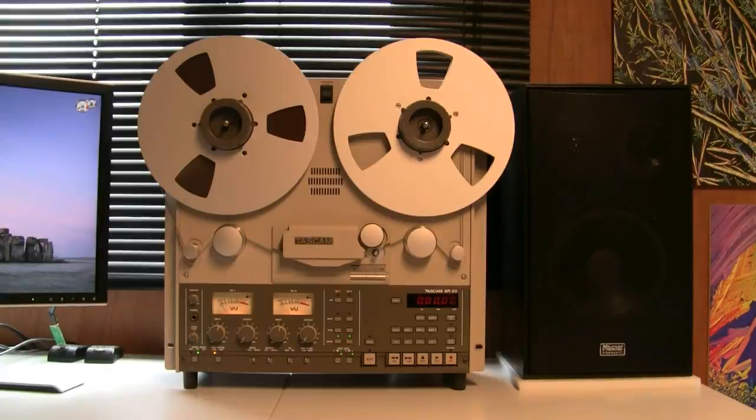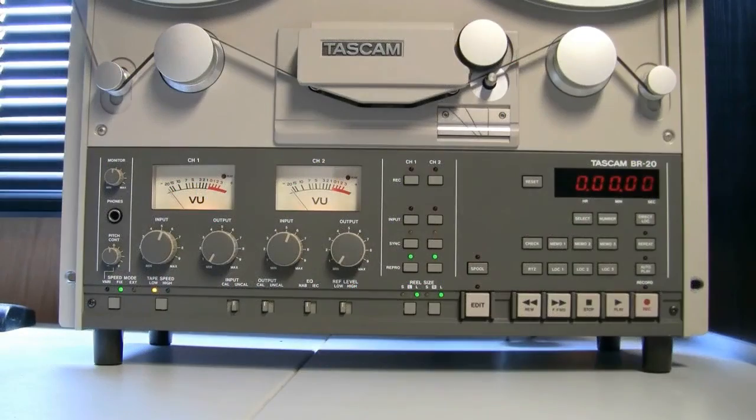I've repositioned the camera to give a better view of the base of the tape deck. Everything runs perfectly — it's very quiet. I've cleaned the transport mechanism with isopropanol, though there wasn't really much to clean, not until I put that rubbish tape through it anyway. For the pinch roller, I looked a lot online about how to clean them — there are dozens of different thoughts on it. In the end I gave it a very quick wipe with a lint-free cloth and some methylated spirits. I got a little deposit off it and now it looks new — no stickiness, no cracking.